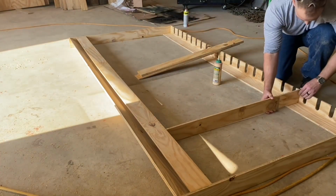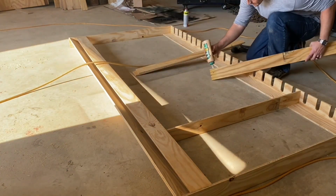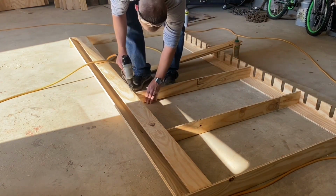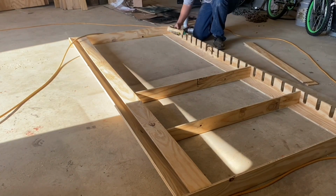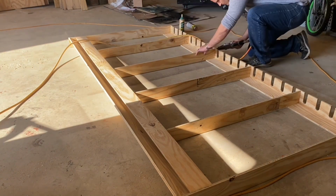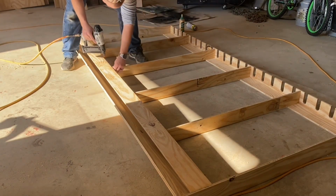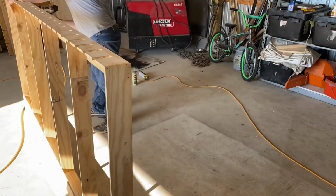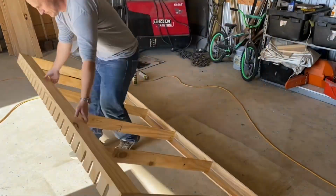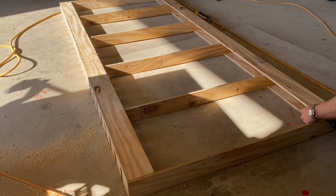Let's attach these 4 pieces evenly spaced between the top and the bottom of our fishing pole holder. I actually made a mistake on these. These should really be 48 inches. Then you should angle the bottom to match that angled 6-inch piece. I'll show you how I fix this problem though. Now I'll attach that last 4-inch board flush with the top of that 6-inch slanted piece.